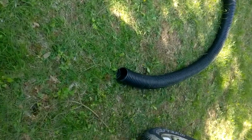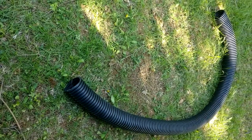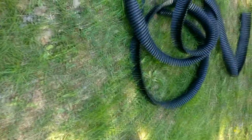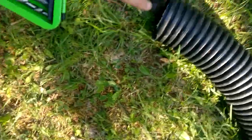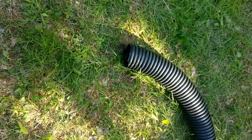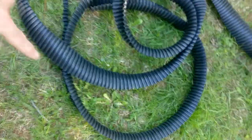Here's what I'm doing for a rain gutter. I had this four inch corrugated perforated tubing, and I cut a strip - it's between a half and three quarters of the circumference. I took this strip out.